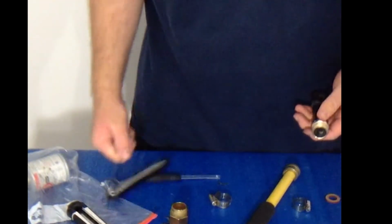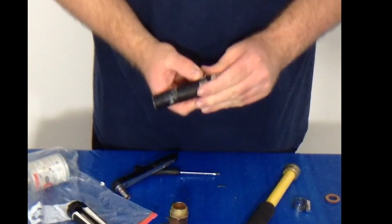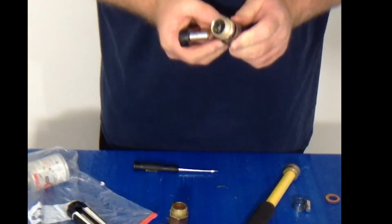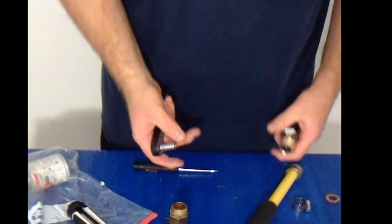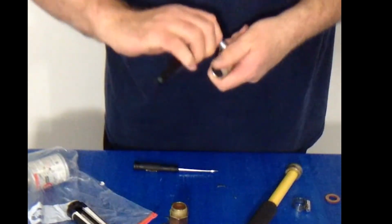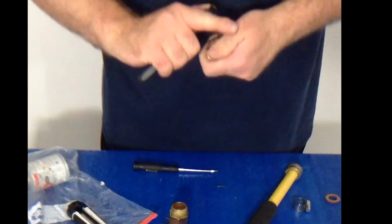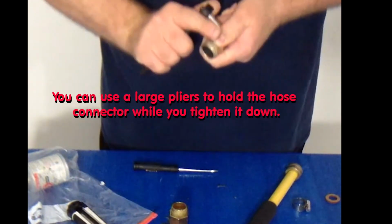Now this is where you need a wrench to attach these. If you don't get these tight enough, to the max torque or yield point, you won't get enough compression. And because these hose ends, when you attach them to hose wands and stuff, tend to get a lot more torsion forces, they can end up breaking the seal. Which is why I really hate those crappy compression couplings they put on the ends of new hoses at the factory. They're really susceptible to this twisting force.